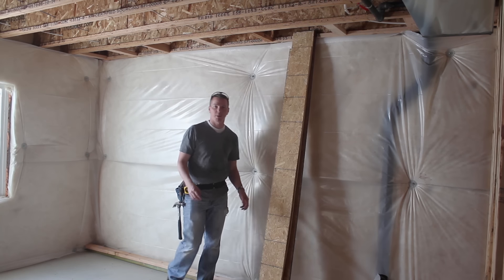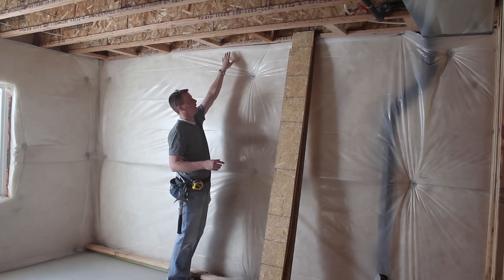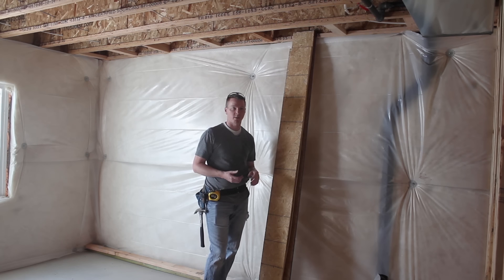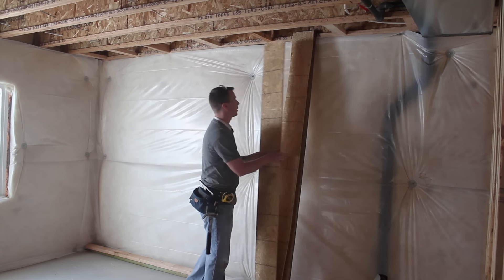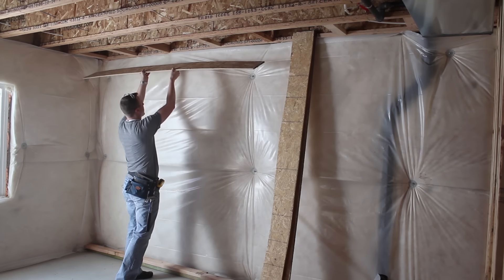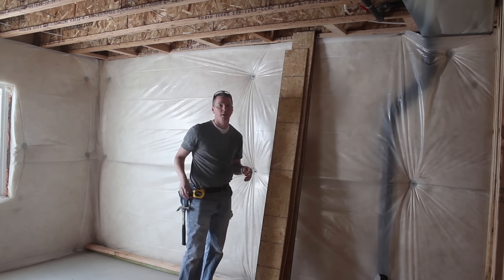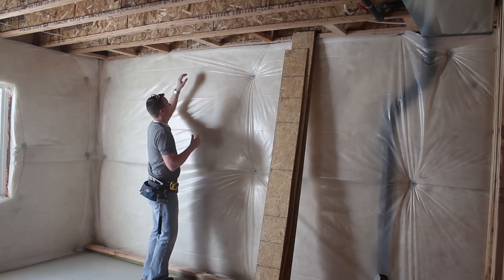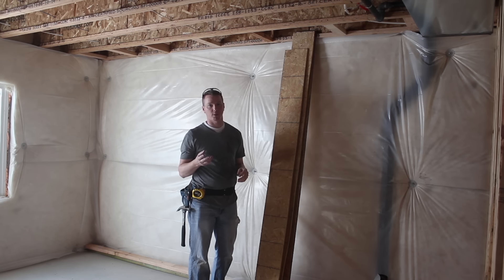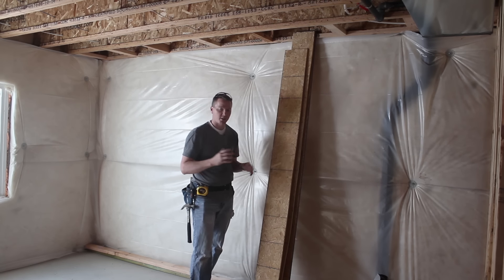One thing I almost forgot — there's a code requirement that you have to have a fire stop on top of the walls so that fire doesn't get up through the walls. You can use several different materials that are considered compliant, so check the code in your area. I've been taking OSB board, cutting through the staples and plastic, shoving that back up in the wall, and then going around afterward with foam insulation to make sure it's all sealed off. That creates a tight seal between the floor joists and the top wall plate, getting me up to code. It also serves a second purpose: it makes it easier when you build a wall on the floor and then move it in, so you don't have to wedge the thing in as much.